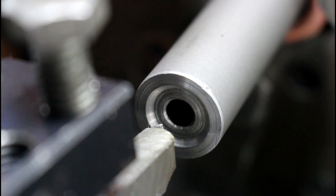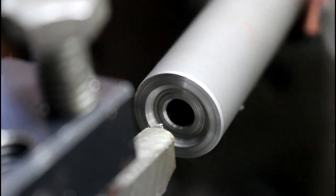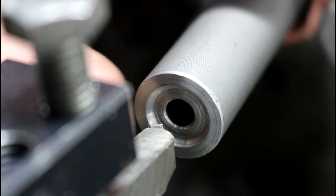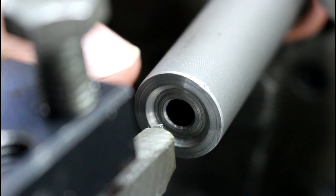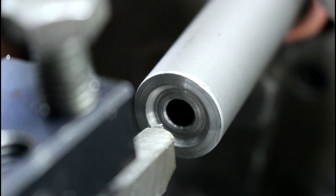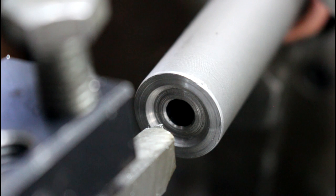Some barrels flex or naturally have bows in them. You know, it's very minuscule, but they're usually there within the bore. What we're doing here is we're just going off the ends, and within an inch here I was zeroed out. So over an inch indicating rod, I was zeroed out at my muzzle end. And for this particular rifle, I think that's pretty good.